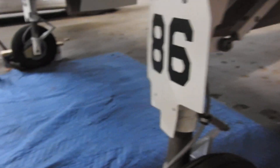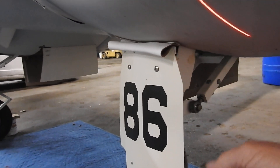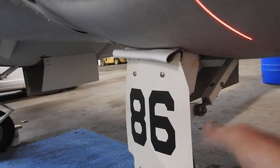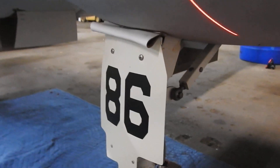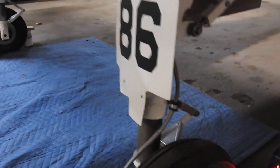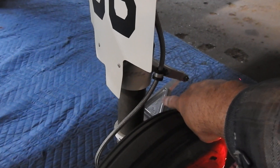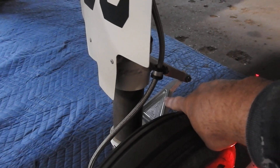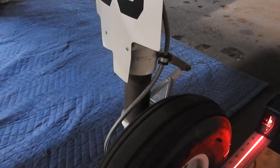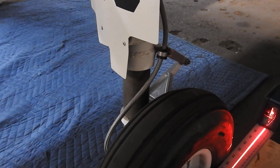My idea was to try to get up into the bolts through the back — there are two quarter-inch bolts. Take them out, turn the gear so the ears fall out of the way, drill the hole oversize, and put the bolts back in pulling the gear out as far as it could go. I calculated drilling from a quarter to three-eighths inch would give me one degree of toe-out. But before that, I had made lower control arm scissors with a degree of toe-out, which only neutralized it to about zero — still about 0.4 degrees toe-in remaining.